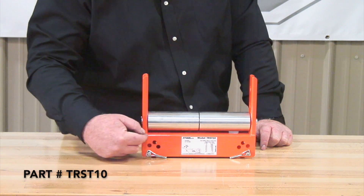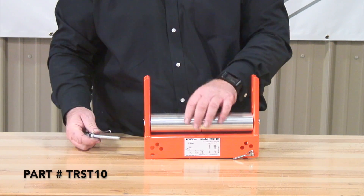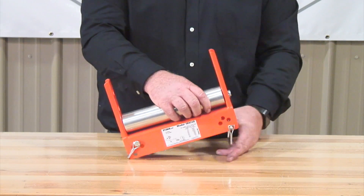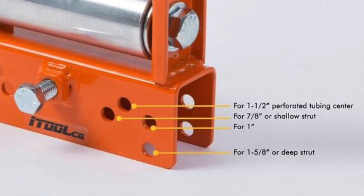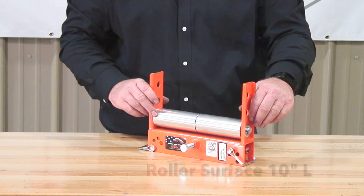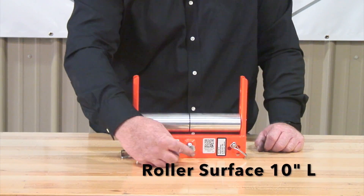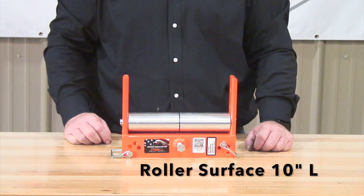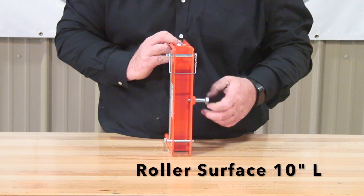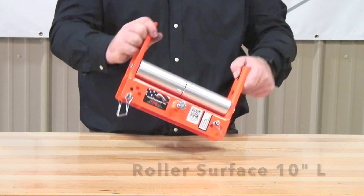You're going to notice all the holes again for whatever framing member you're inserting to. For example, if we're inserting this onto a perforated inch-and-a-half tube, that would be that hole right there. This side was already set up for an inch-and-five-eighths strut, so just make sure that's underneath your strut. On the back you'll see the half-inch bolt — tighten that onto whatever structural or framing member you're mounting it to. Tighten that onto the framing member, making sure your two locking underpins are installed, and you're ready to pull wire.